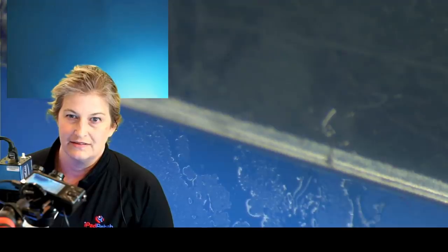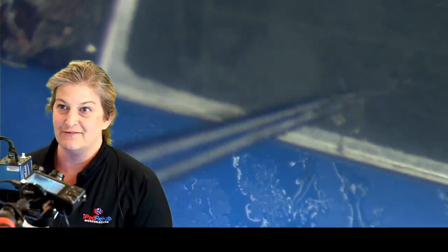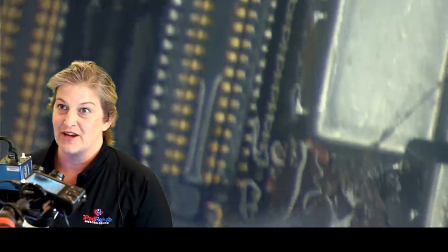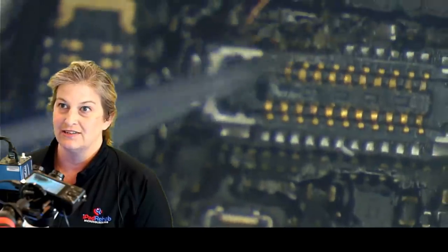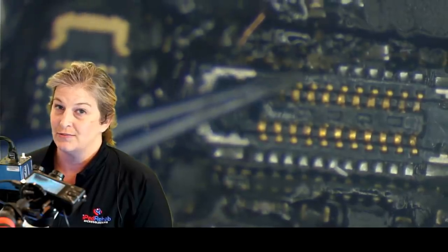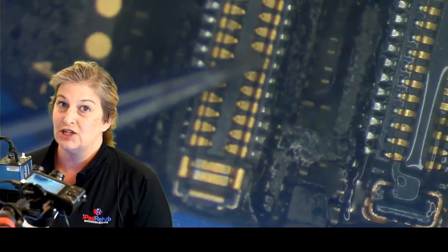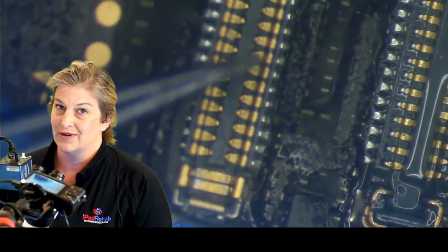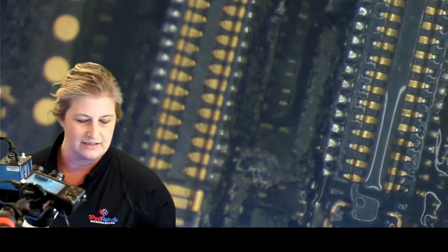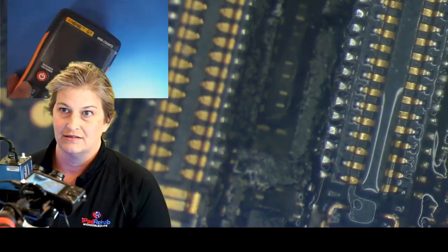So now, if we have actually made a line from the CPU to here, tagged into our micro jumper, coming around here to the third pin at the home button connector, that should, because there's continuity over here to pin 32, give us our normal diode mode reading on that line, when originally it was OL. So that's the big test. Let's see. Have we made that connection? All right, let's find out.